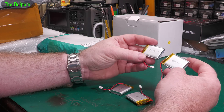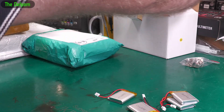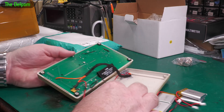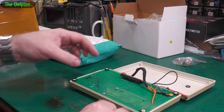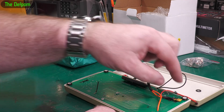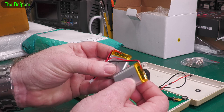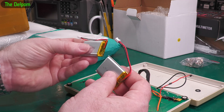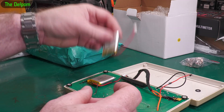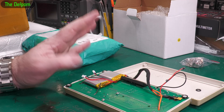So I decided to get this type instead. I can actually use two of these packs inside the unit. Basically I had a pack sitting here which was five cells - nickel metal hydrides - and they just weren't working right. I'm going to replace it with two of these. Now these actually have little BMS modules built into the cells. So I don't actually know if I need to worry about putting an external BMS on. I'll mount these in here, stick them in series, wire them up to the original wiring, and that should be good again.